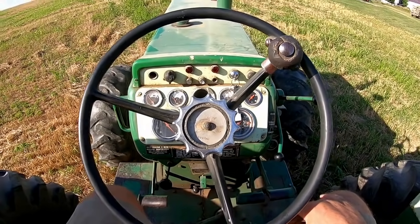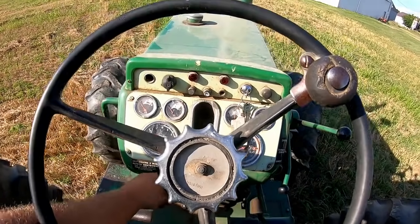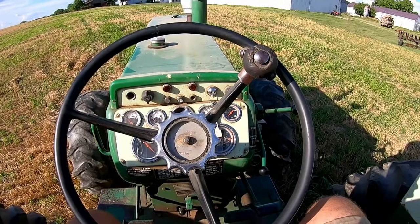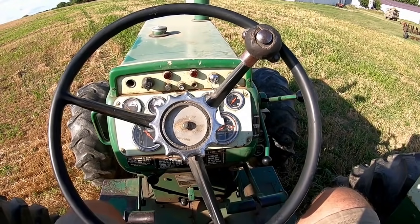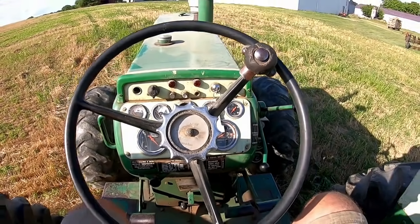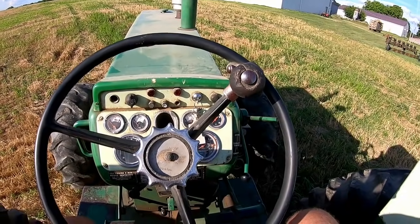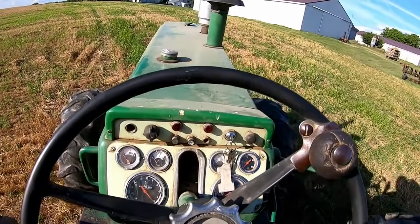As far as checking them out, check the oil. Oliver usually used automatic transmission fluid - Dexron 3 is a good replacement, so if it's red in color that's what's in there. If it's clearish to light brown, it's most likely a universal fluid, which is a good substitute. If you're going to clean it or change it all at once, a good test for these is to drive up a hill.